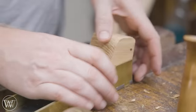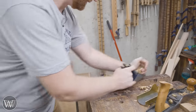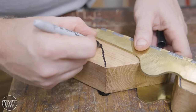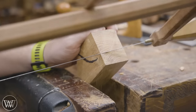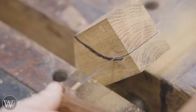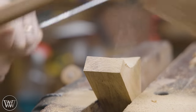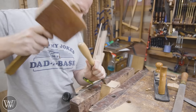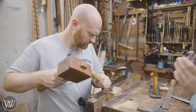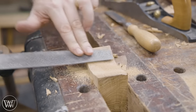I want to make this fit exactly — it needs to come down by a few shavings and then slide in there. I want a really nice, tight, clean fit. We're going to shape the back half and make sure that fits in as well. This one was a little bit tight, so I want to come back and take another shaving off. For the back side, I originally thought I'd come in with a chisel and notch this out, but I decided to use the turning saw. I don't normally grab it for something this thick as it can be a slow cut, but after doing it a little bit it worked out pretty well. There ended up being a little bit of a turn at the end — I didn't keep it quite square — so I came in with a chisel. We're going to be doing a lot more detailing later once we get the tote made, but for now we're getting it close to the shape, cleaning it up with a rasp and file.